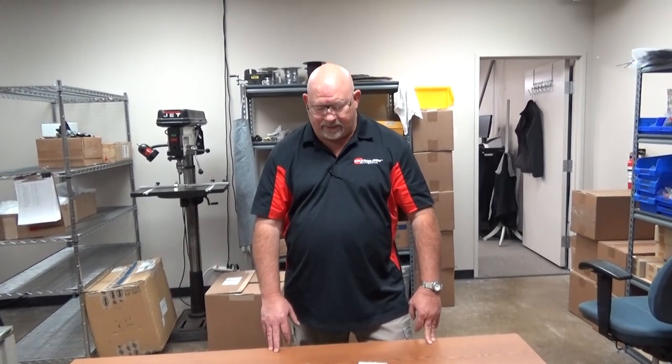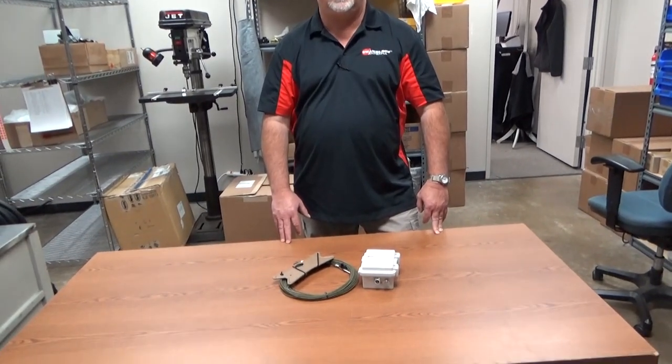The wire is very hard to see — I can vouch for that having one myself. Especially when there's a background behind the antenna, it just blends right in, which is another benefit of the small-diameter wire. It also has Kevlar thread in it to prevent stretching and increase strength, so you can put it over your house if you need to — we don't recommend it, but you can. These antennas will perform in a poor installation, you're just not going to get the best efficiency. Get the thing up somehow, start operating, and you'll learn from how the antenna is behaving. That's what ham radio is all about — experimenting.